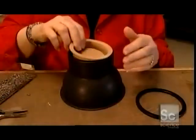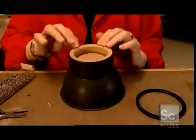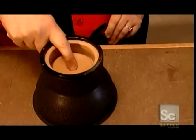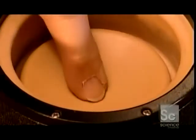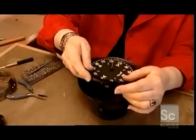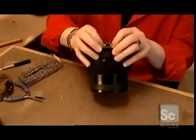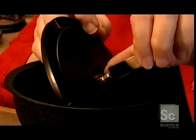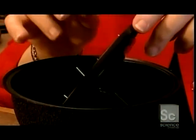The technician spray paints the metal compass bowl black and pops a rubber diaphragm into it. A bronze ring will hold it in place. This flexible rubber liner will contain the compass fluid and allow it to expand and contract. She snaps the dial and gimbal setup to the bowl, then bends a little tab to level it out.